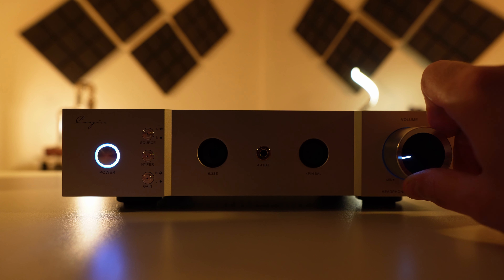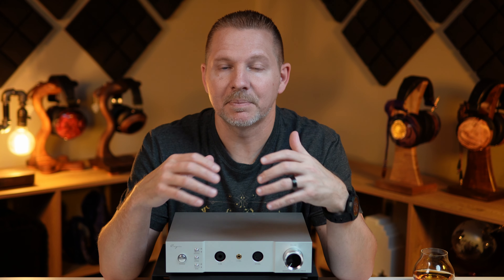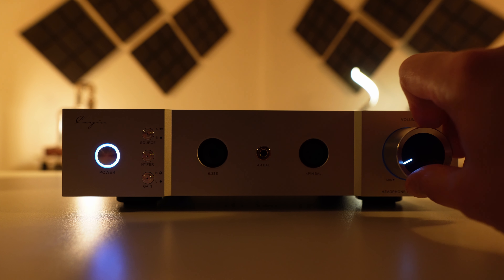Lastly, we do have a volume knob, which has also been updated in a couple of ways from the IHA-6. The knob has a white glow when the amp is on — love that. It is also an ALPS customized step potentiometer combined with a pair of high-end 130-step electronic volume chips, meaning it is an electronically controlled volume adjusted in the analog domain. Kind of a best-of-both-worlds situation. When you adjust the volume you get this wonderful stepping feel as you turn it up or down. I love the knob on this one just a little bit more.